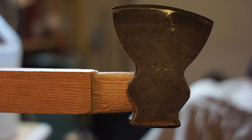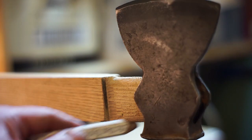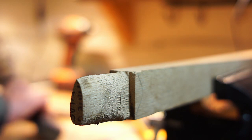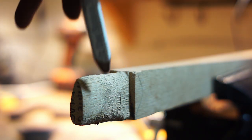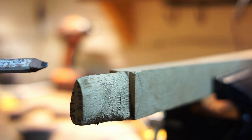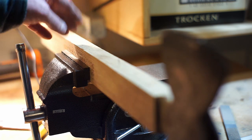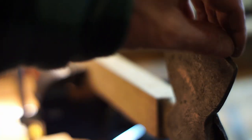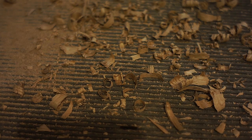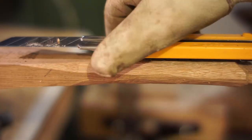I don't know if you can see that rub mark, but it's quite noticeable — the wood's all flattened out there. That's obviously something I have to take off, so you're just kind of looking for those all around the axe head and looking down the middle, making sure it's tight and the profile looks good, and you just keep taking material off until you've got it. I'm not worried about putting padding between the handle yet because I've got a ton of material to take off. You should probably put some tape on the axe head so you don't get cut — I'm not going to, but this thing's pretty sharp. That's my ghetto spokeshave.